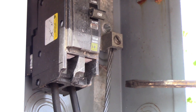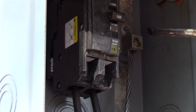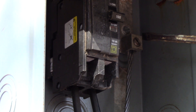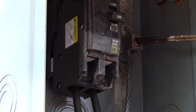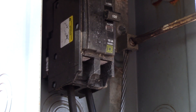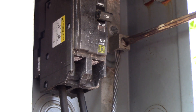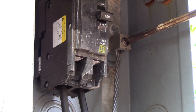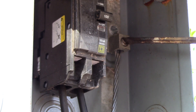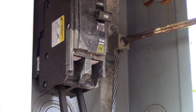So I opened up this box and chased a couple little lizards out of there. They don't know how lucky they are, because if they had got across the two hot wires up above — the two bus bars coming down from the meter — that would have been the end of the little lizards. Checking this lug here, the neutral lug, which is tagged off and bonded to the can of the meter socket with the 100-amp double-pole breaker — that's where the ground wire was also attached — and that lug is completely seized. I can't budge it, and the neutral system ground there is very loose. I've sprayed this with WD-40; hopefully I can free that up, otherwise I'm going to have to change that lug and re-terminate these properly.